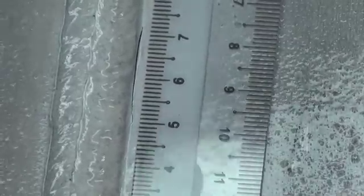The second indication in the base plate is shown right here — it starts from here and goes up to here. The indication is very clear. This was the demonstration of the wet visible magnetic particle method. In summary, the steps are: check the light level, check the magnetic field adequacy using the shims, then spray the white contrast paint and apply the wet visible particles, and make sure you do the inspection in two directions which are 90 degrees to each other. This completes this video. For training of this method please contact our office. Thank you.